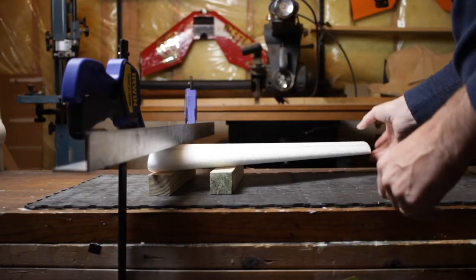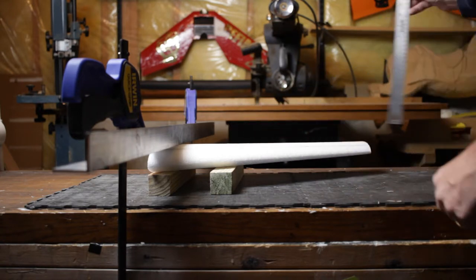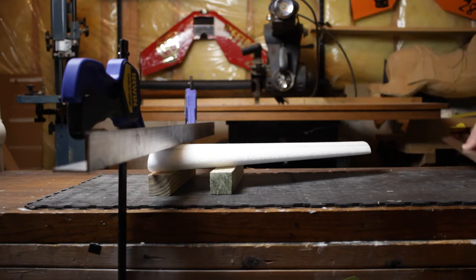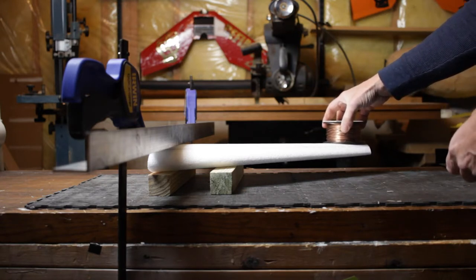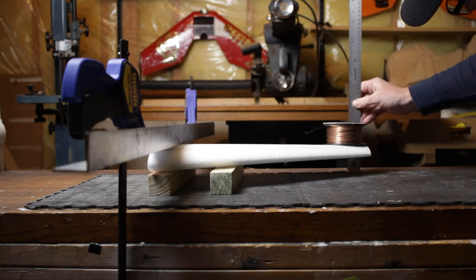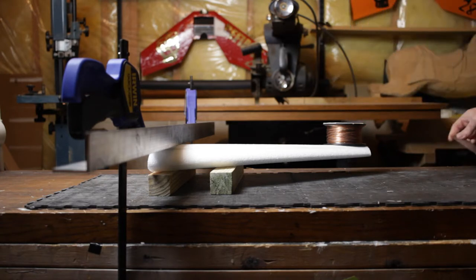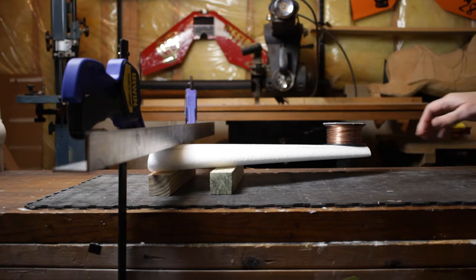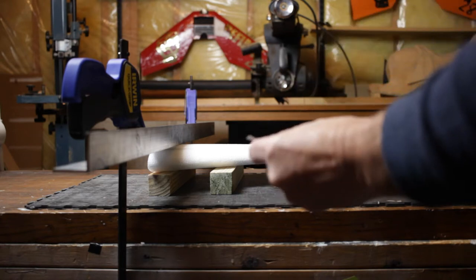Here is our reinforced wing. I'll show you — this one has the reinforcing in it. I've measured it and we are at 65 millimeters in the back. Now when I go ahead and set this two pound roll on here again, you're going to see that we dropped very little. We are at about 57 millimeters. So we've dropped about 8 millimeters, as opposed to that large drop we saw in the foam by itself. So this is much more rigid, much stiffer, just by adding in a couple of pieces of this reinforcing fiberglass rod.